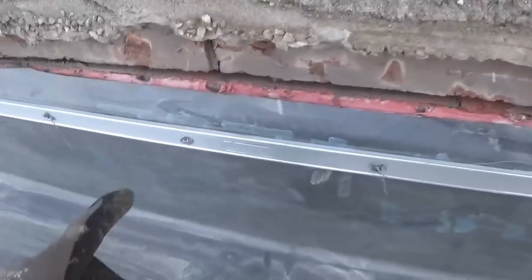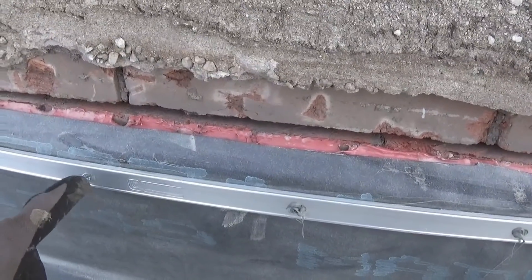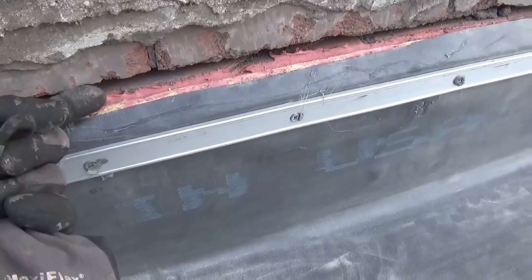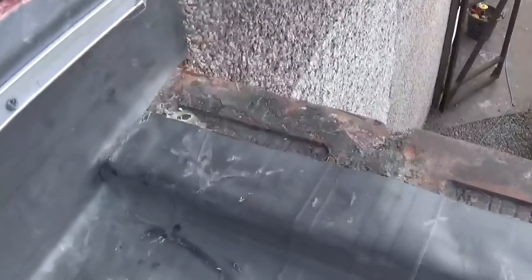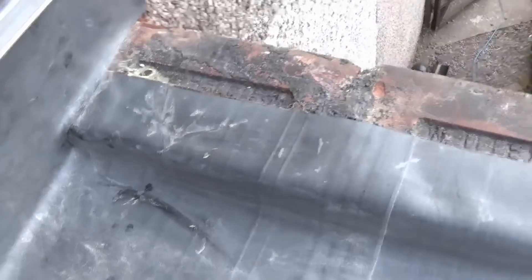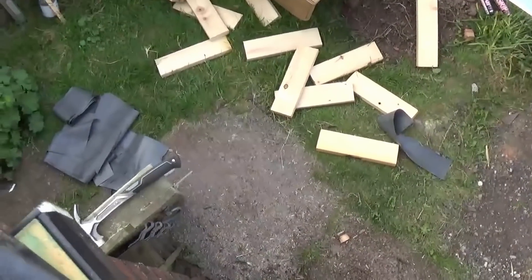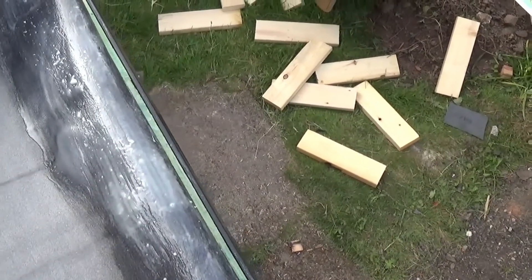We've rolled the whole roof on. When we've turned the rubber up we've put this metal termination bar along here, which is part of a roofing kit, then screwed through it with a bead of sealant all the way across behind it, so that when we screw it up it fills any holes created by the screws. I'm still having the lead come over there and cover all of this. We've done exactly the same along the back under the overhang. At the front edge, we've made a cut across the rubber so one flap goes underneath and the other falls over so any water drains that way. On the side we use the contact adhesive all the way across, creating a good bond right into the front of the roof.